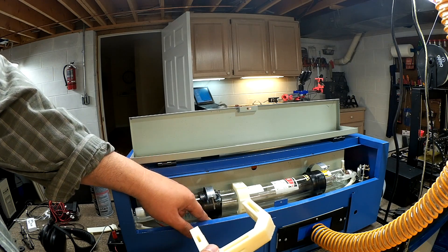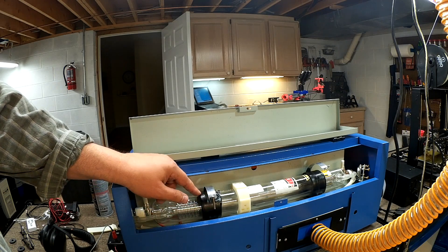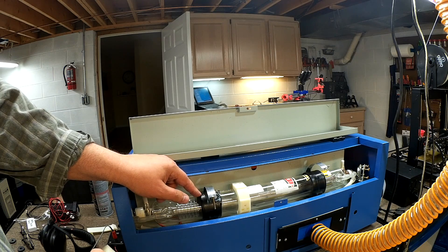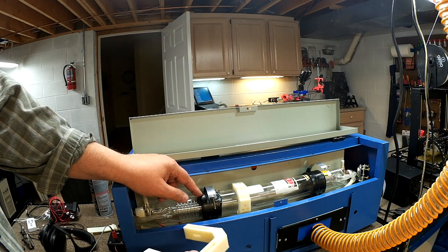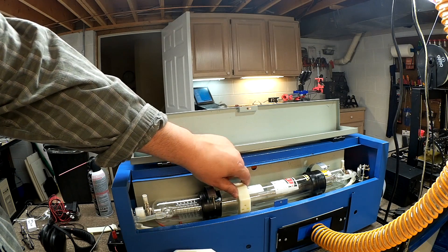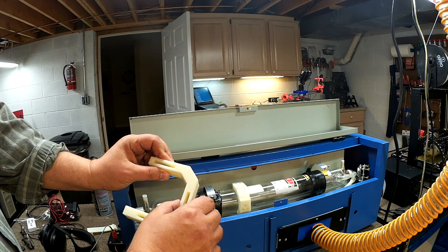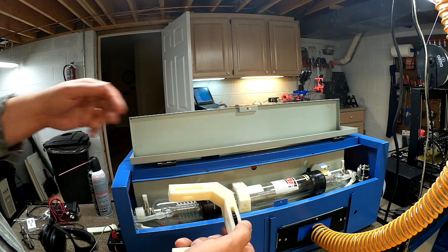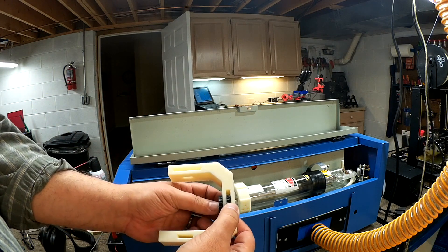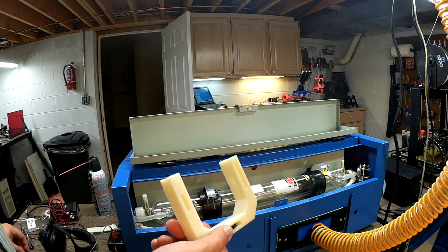For the 40-watt machines there's a metal saddle block that the tube sits on, with some funky padding I may have to cut off to get these clamps on. The clamp just snaps onto the tube and sits in the saddle. It has X and Y adjustments with thumb screws — one adjusts and one locks. It's a nifty idea, but it doesn't fit my machine.